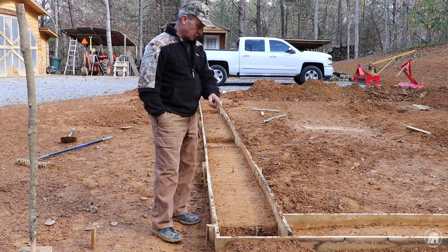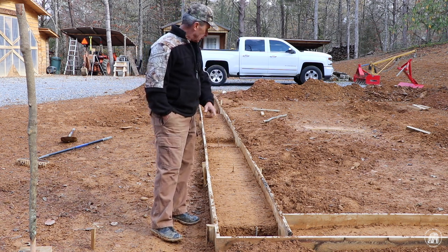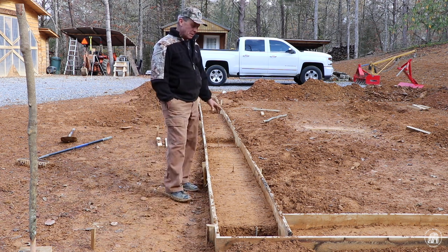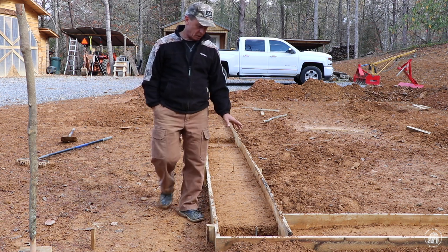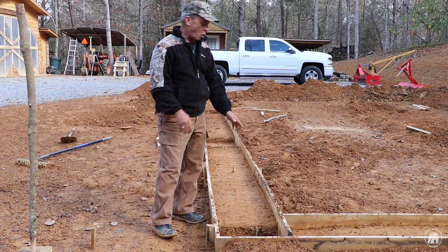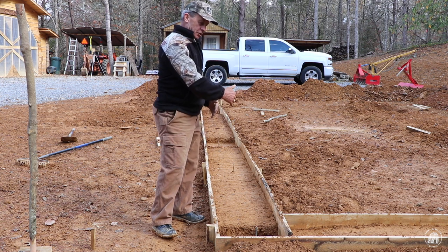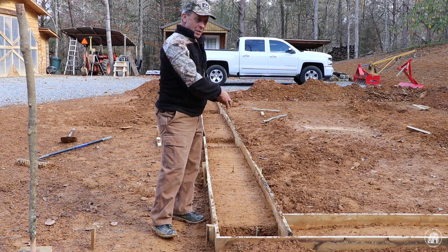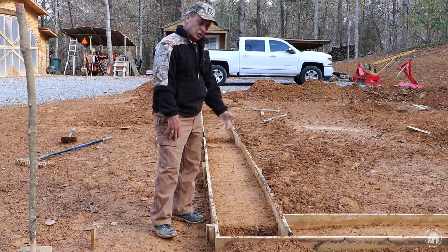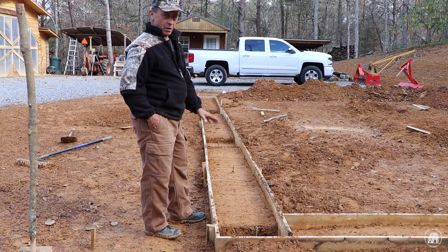Anyway, these areas here, like on the corner, that's where the posts are actually going to sit. In between these two, it's not very thick, but I don't need it to be, because primarily it is just a foundation to put a small wall between my floor, which is going to sit right here, and the bottom. Like I said before, I'm going to put some sort of backing, like a little 2x4 wall from here down to the concrete to lay rock up next to. That will give me a flat surface to do it, and it won't be right on the ground.